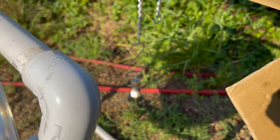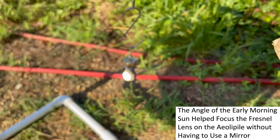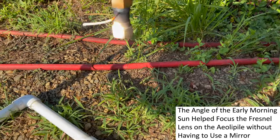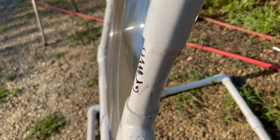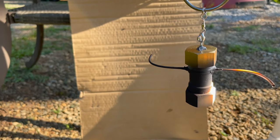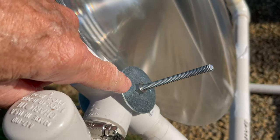I found in earlier work that the groove side of the Fresnel lens works better facing the sun for a tight focal point, so that's how I've got it set up. I didn't have to use a mirror, which takes one little hassle out of it. Early in the morning the sun is low in the sky and comes in at a reasonable angle. We will use up the water — it's not a huge amount in there — but that's why it works: you don't have to heat up a huge amount. The solar alignment guide is well centered with no shadow around it.